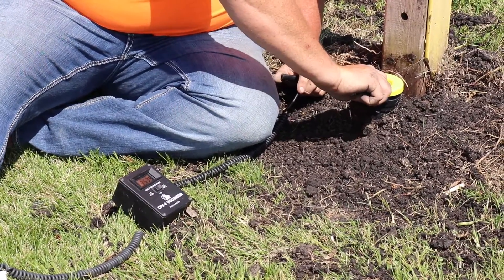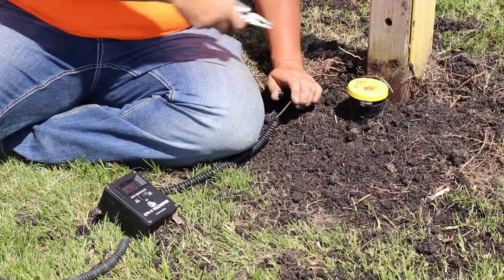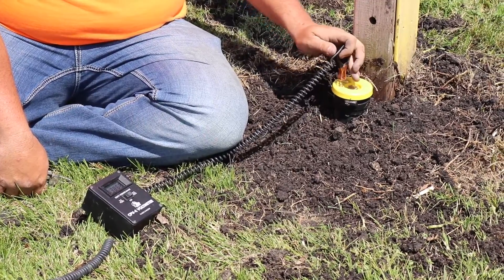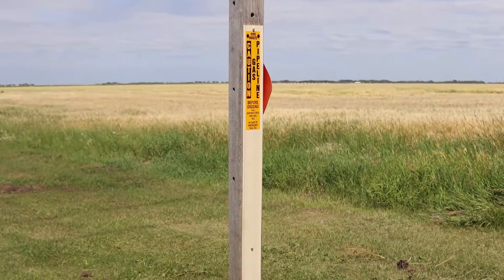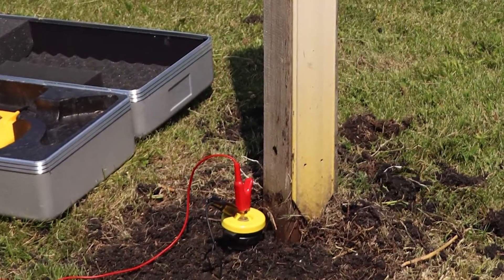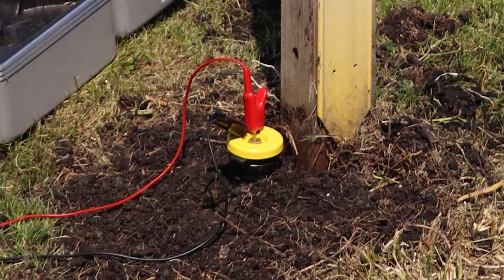You can hook on, check your cathodic, open the switch — that's just like taking your wires apart from the wing nut — and there's no longer a need to take the lid off and take the wires apart. It's just a switchable lid. It's also a great spot to locate off of; you can hook on quick, open it, and you actually have a ground there at the same point for your locator, so it works pretty slick. Our state inspectors are really impressed with this technology advancement and where we're going with it as a small town just trying to stay on top of it. They're really impressed with the Coverhead product.